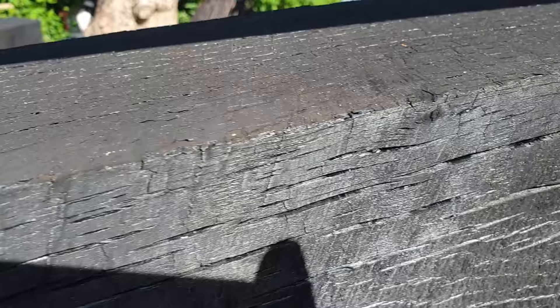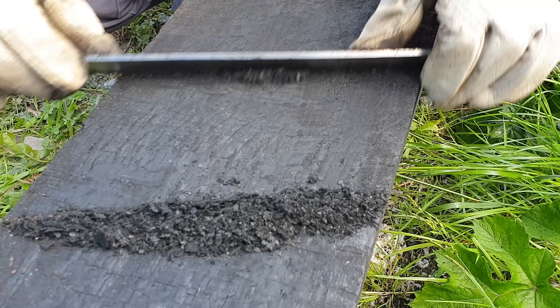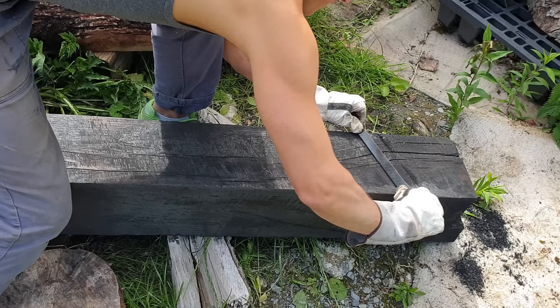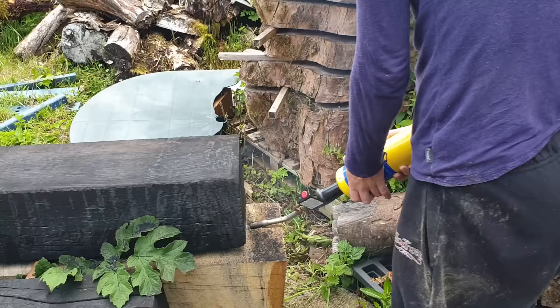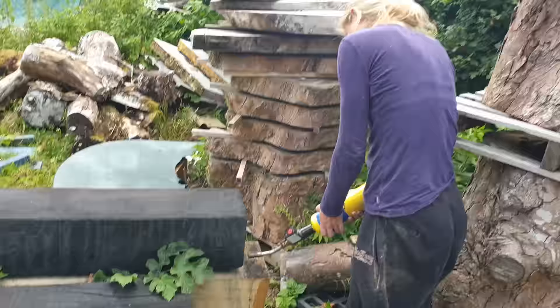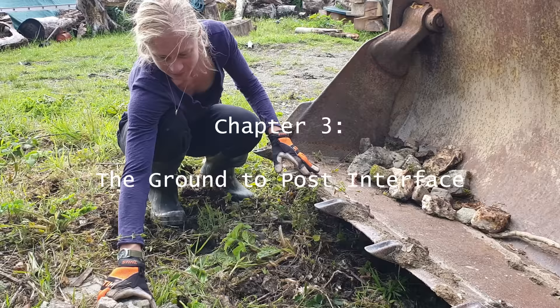The very outside layer of charcoal can be scraped away — at least in our experimental rendition, this is what we're doing. The theory is that the outer layer of charcoal can trap and hold moisture, acting a little bit like a sponge. The rocket stove worked great for this; we're hitting the few patchy bits with a propane torch and we're sure glad we used the rocket stove because that's a lot slower. In our little mini-experiment, we're charring three of the six new gate posts and will report back in 20 years or so.